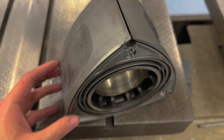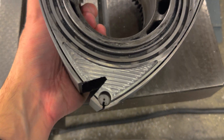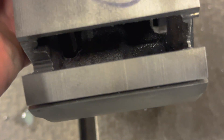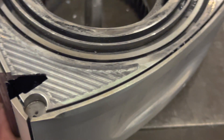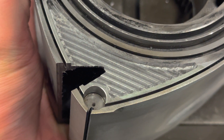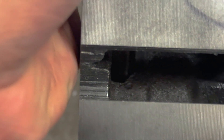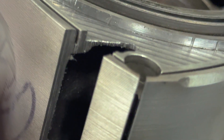The rotor's now sort of finished with the program for milling at the corners. I've done a slot inside to see how much material I can get away with. With a three mil depth of cut it's getting very thin right there, so I'm probably not going to go any more than two mil. On other castings it might be even thinner than what that already is.